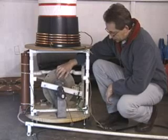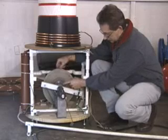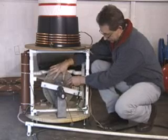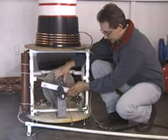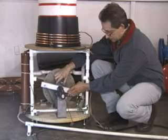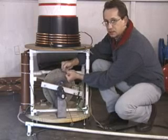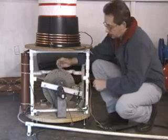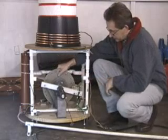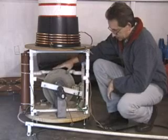The disc itself is attached to a pulley with 3 grade 8 bolts, and the pulley and the disc is one assembly. I slide that over the shaft, put a press center hub into the center of the pulley — that clamps onto the pulley, pulls it back onto the press center hub, and in so doing clamps itself around the shaft of the motor. It makes a nice tight fit, very secure, and there's no wobble like you might get with set screw designs.